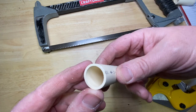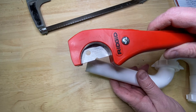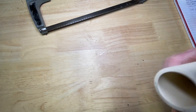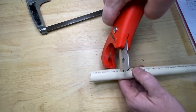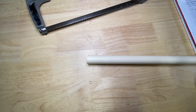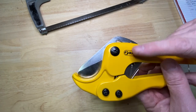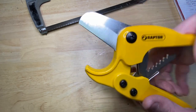You're able to hook that right up. This other style of manual cutter works great on thinner type pipe, but when you try to start cutting thicker type PVC or CPVC with it, it's really hard and it just doesn't work out so well. That's one of the reasons why I ended up buying this, because I was installing some inch and a quarter pipe. You guys saw me do that on my friend's frozen water line a little while back, and that's why I bought this — it worked out awesome.